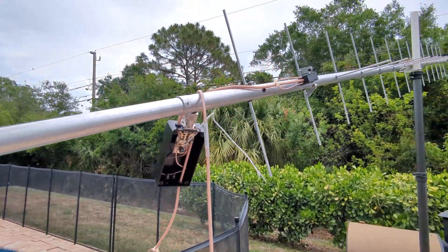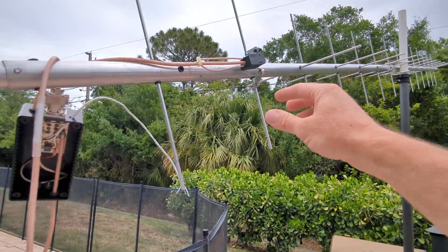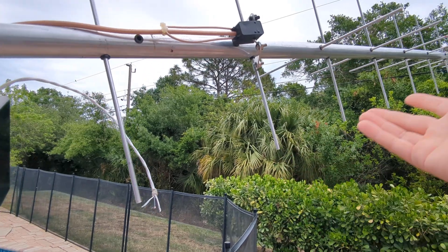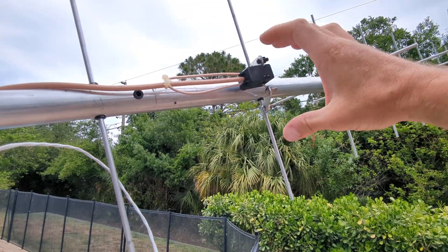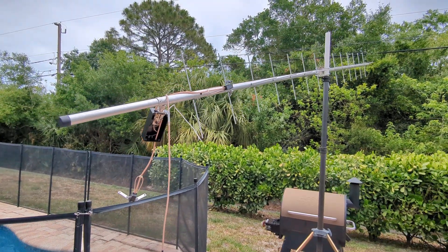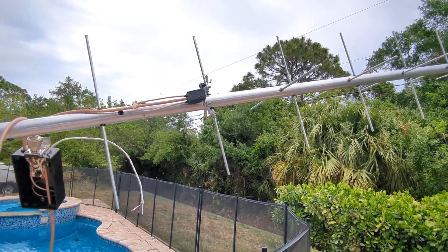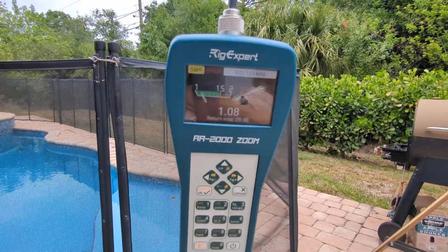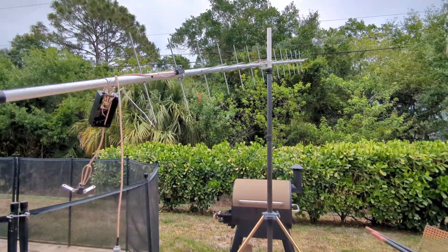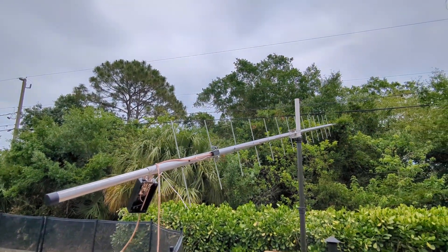In the unswitched position I am seeing the actual antenna. A lot of people said I'm probably just seeing what's inside the box — that's why nothing moves when I adjust. I put a 3/16 steel rod in, cut it three inches longer — nothing. I spread them all the way out — nothing. But by putting the reflector and driven element farther away, that's what gets me that 1.08–1.09 SWR, probably even better if I'm up higher and away from the grill and the metal poles around the pool.